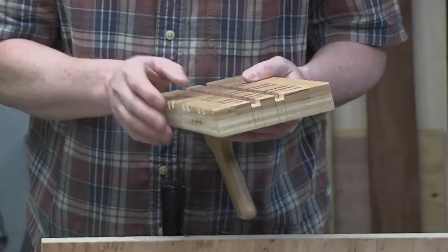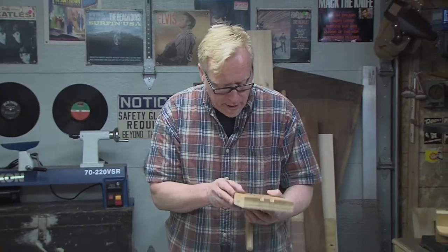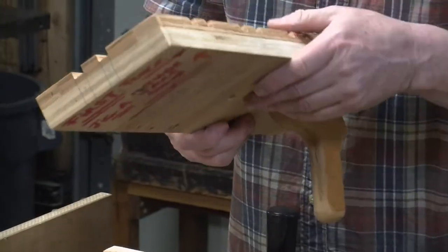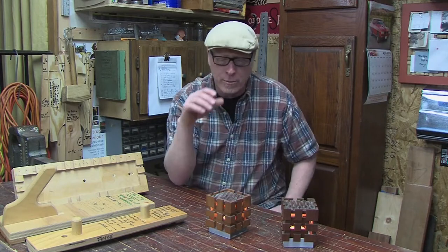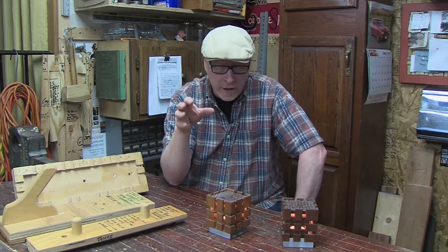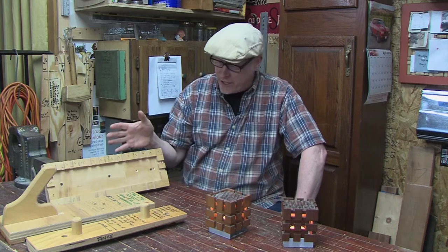That looks great. Now, mahogany is soft enough that you don't get a lot of tear-out, but you want to take your time. You don't want to go too fast or you'll get a lot of tear-out, and if you go too slow it can burn. So just a nice steady pace. I'm going to pop this one out and then we're going to use our second jig. I really enjoy making jigs for projects — the project itself is rather simple, the joinery is not over-complicated, but you need to spend some time thinking about and making these jigs.